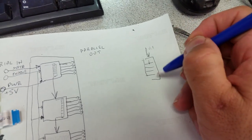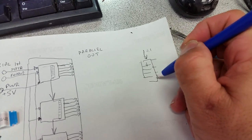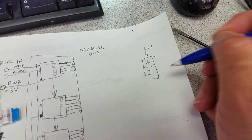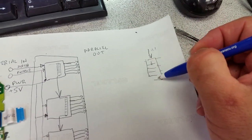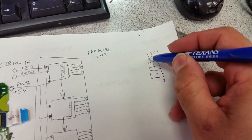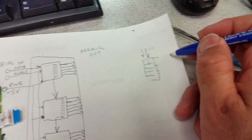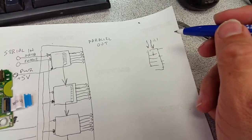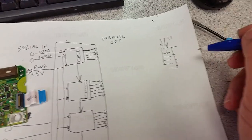And when you push so many down, you basically fill up the register, and each one of those is a valid output. And if this shift register has 1, 2, 3, 4, 5 cells, in 5 steps, zeros and ones can fill that up. And usually there is another signal down here that says, okay, now that you fill them up, flush them to the outside. It's called flush or set or enable, or my terminology would be a little confusing to people who are good with those things.